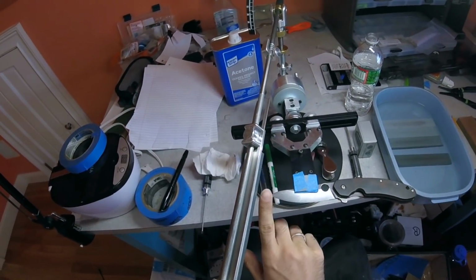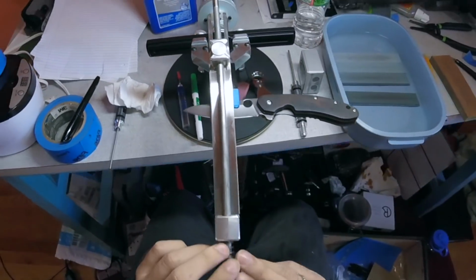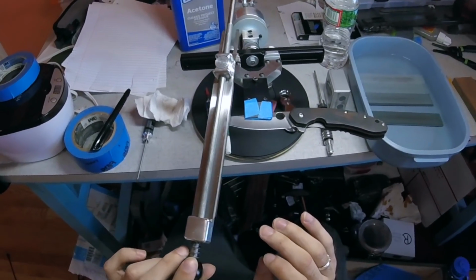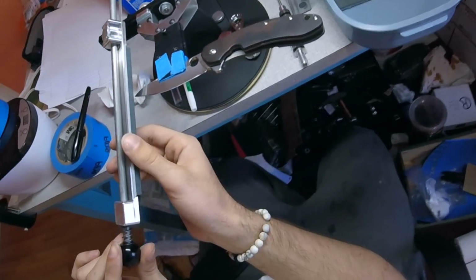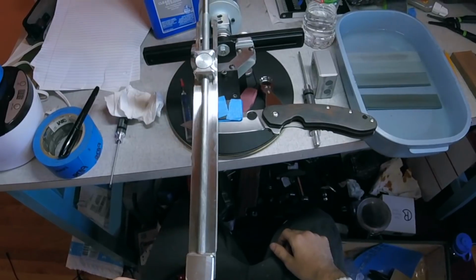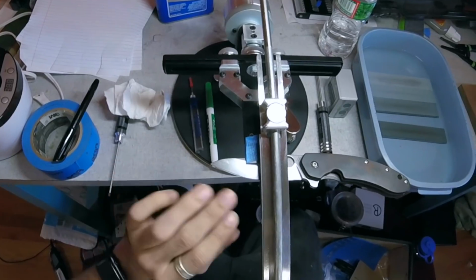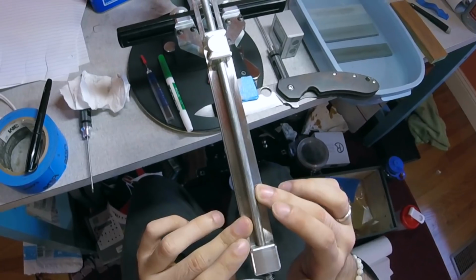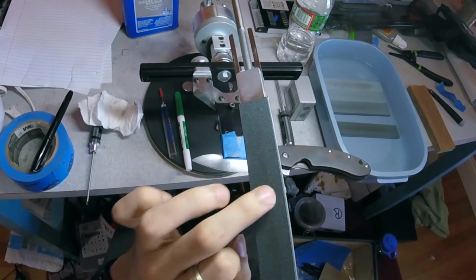The tip. I want to talk about how to sharpen a tip. All right? What you want to avoid, I want to demonstrate this well, is coming off the edge and letting your stone do this. So what that's going to do is round the tip. Okay? Now, the problem with that is the tip is almost always going to be on a belly. And when you're on the belly, your stone can rock. Hopefully you can see that. Because your stone is only making contact with the blade on a little piece of it.